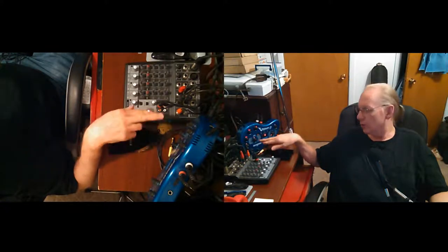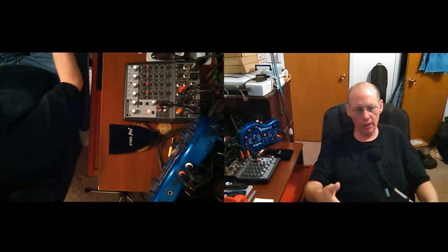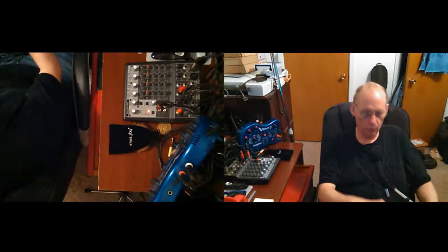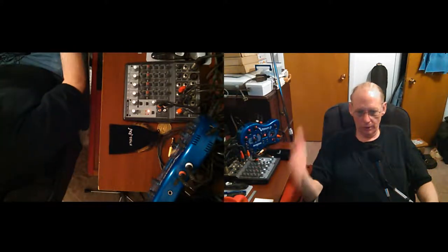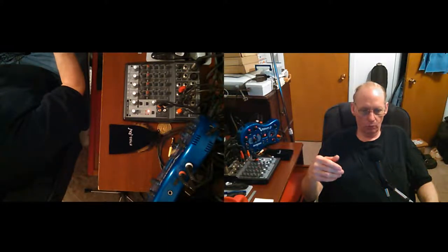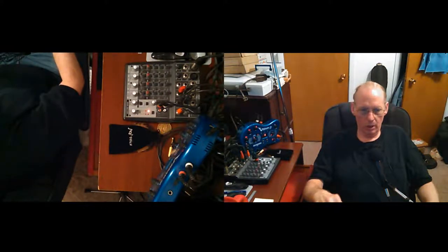So anyway, you go from here to here, and then you go into the computer. Well, then that sends out an analog signal. I do know that. It sends out an analog, not a digital signal. So when it gets to the computer, then the computer converts it to digital so that it can work with it. So there's an ADC, you know, in the computer, analog to digital converter. And so that's fast. Even though that's going through all that, that's fast. But no noticeable delay.